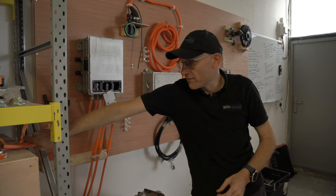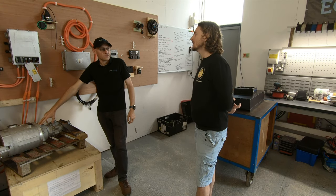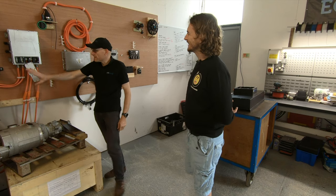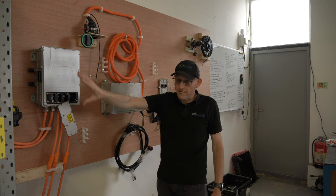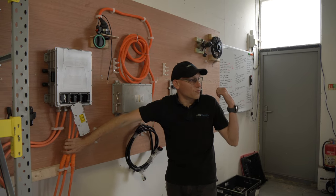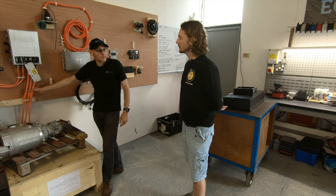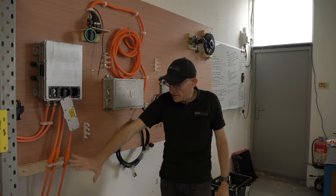The connection from the battery goes into the inverter, which is matched with the motor. The inverter takes the DC from the battery and turns it into three-phase AC — direct current into alternating current. It's also three phase. Your normal house supply is probably single phase, so you'll have a live, neutral and earth. This has effectively three lives — three phase.